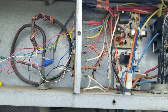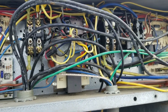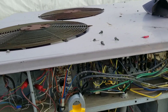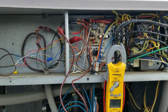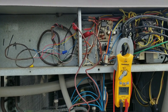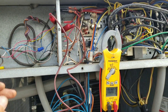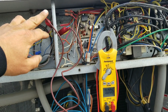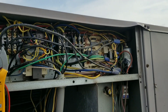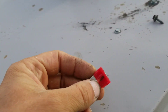I got tired of waiting for my thermostat to initiate a call for cool — the area where the thermostat is was a little too cool. So I installed a jumper from my red to my Y1, and immediately when I did that the fuse on that control board popped. Then I went over and noticed that somebody had replaced it with a 10-amp fuse.